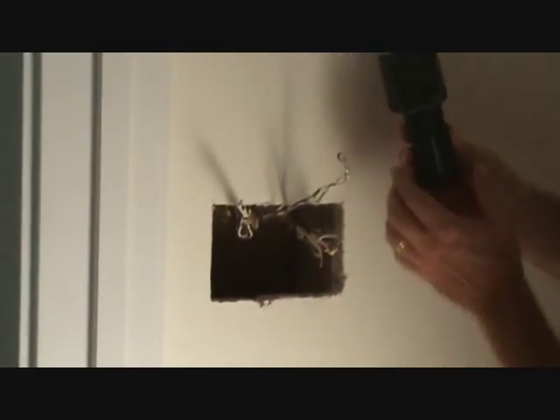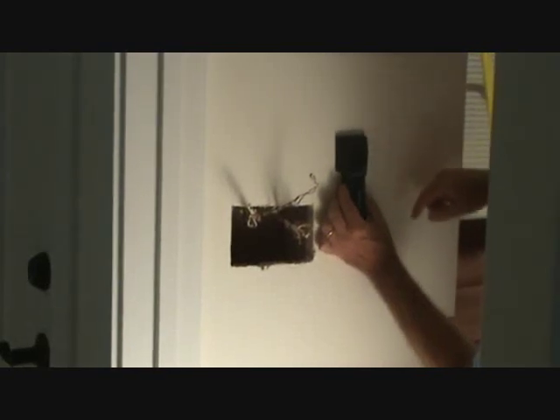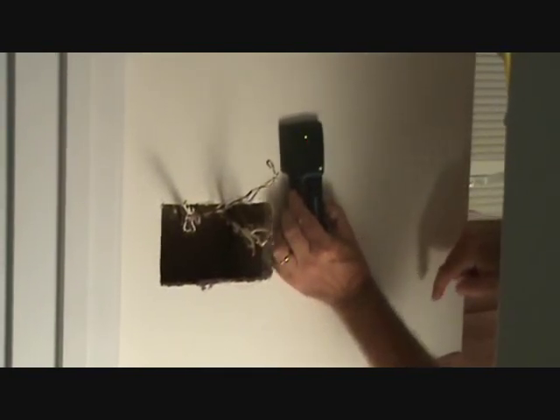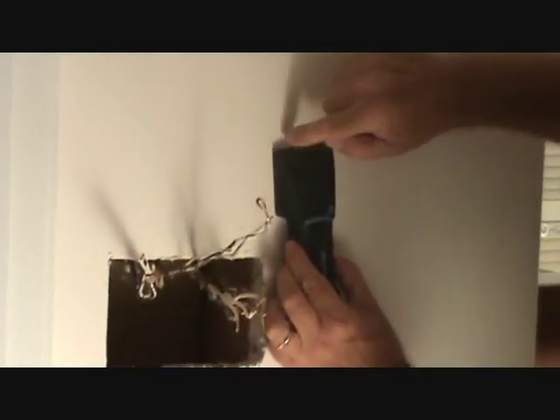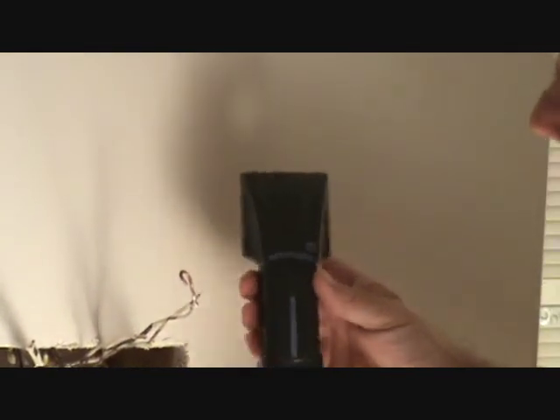Another way — this is a stud finder. Another way to find the stud if you were wondering why I use the nail method. The nail method is a good way, but you can also get a little stud finder like this. This helps you find the studs inside a wall or the ceiling joists. What you do is run it across the wall and lights will come up here. See the red lights? Once it's green, that means that's where the edge of your stud is, from there over this way if you're sliding it in this direction. Now it's green — there's the edge of the stud and the stud is from there over. Measure over three quarters — there's a little notch here, that's three quarters. Put a little pencil mark there and that would be the center of a stud. So this is a handy thing if you're doing little projects around the house. It's nice to get one of these — read the directions. Stud finders are a good thing.